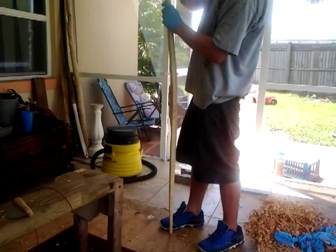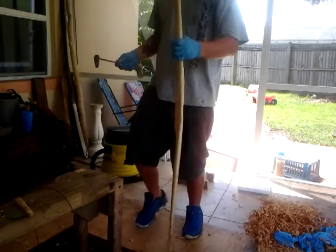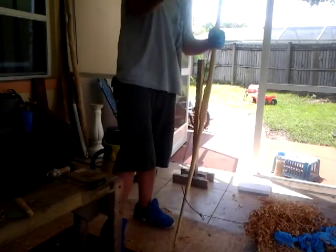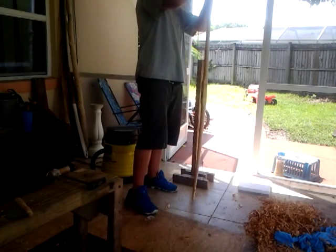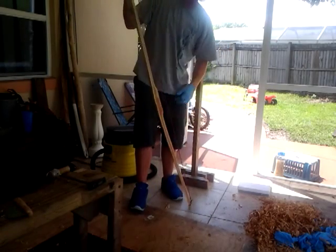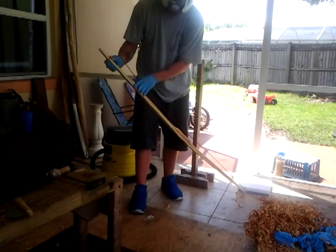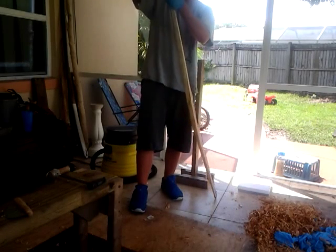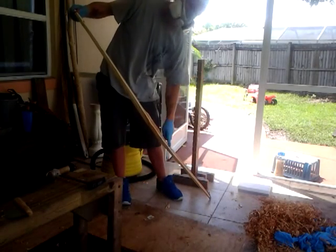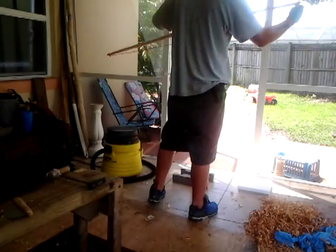Alright, now that I've got all that sapwood rounded off, let's go ahead and throw it on the tillering tree. So you take your tillering string. Now I've got the limbs memorized because of knots. This one has a knot right towards the tip. So this is A and this is B. I've been working on A because B was bending more than A. So I'm going to put A on the right hand side.